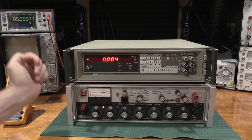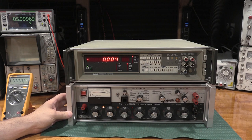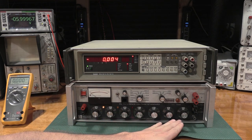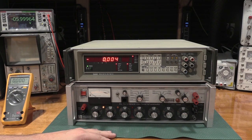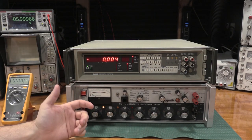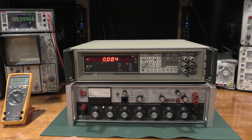We're running a standard deviation of 32 microvolts, which is actually pretty impressive for that Rigel power supply — I expected that to be worse. We'll see what happens with some transients as we let it run. One of the main differences between the Rigel power supply and the EDC power supply is the EDC is much more precise — you can tell by the amount of resolution it has — which also means it's much more stable. That's the main difference between the 7510 and the 6500: the 7510 has a much more stable reference.